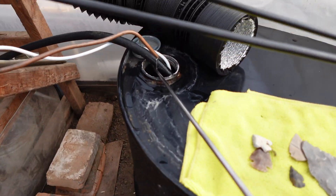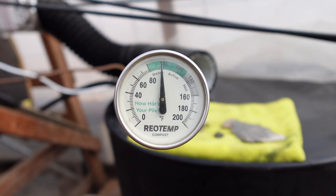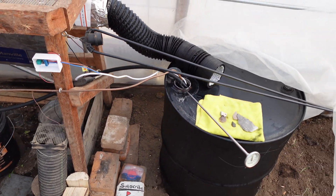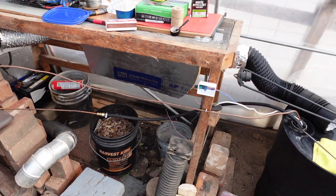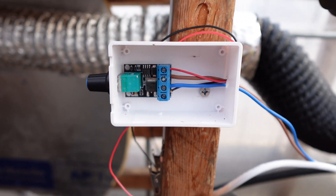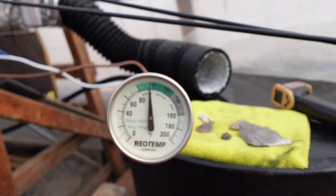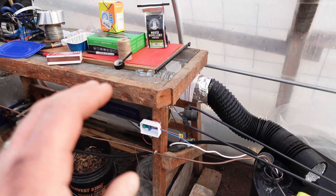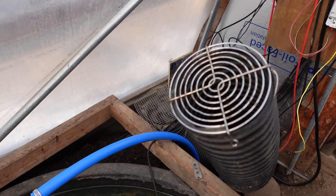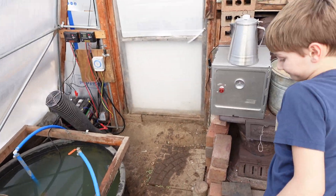Pretty much design a large boiler system. With a little bit of refining, I was able to get our temperature to basically level out at about 98 to 99 degrees and that is constant — we're just continually putting heat in for the last 20 minutes or so. After about half an hour the sand really heats up and loses that negative draw from being cold. This motor speed controller is really shining here because I'm able to fine tune and control the rate of flow on this system. We've got the fan blowing behind the bricks and our compost heater fan blowing back there too, so everything's operating as it should all together.